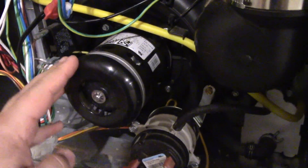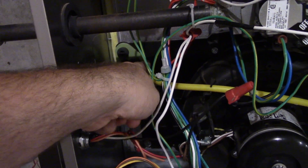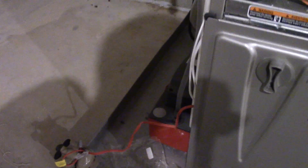A lot of parts I'm sure you're familiar with. Here's your inducer right here. Here's the pressure switch. Here's the exhaust pipe. Your gas valve. And your burners. The flame sensor is over here, and the hot surface igniter is over there. And the condensing portion kind of happens within here. You see this yellow tube right here? The condensing collects inside there, then it goes down this yellow tube into the water trap, which is this thing right here. And then as it collects water, it goes out through this tube to the left behind the pressure switch, out the side, and it goes into the condensate pump. It doesn't run all that much too often, which is good — also because the furnace doesn't run that much, which is definitely efficient in itself.